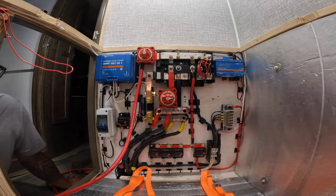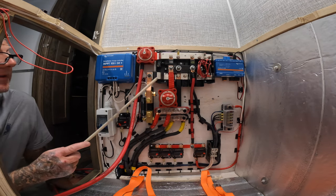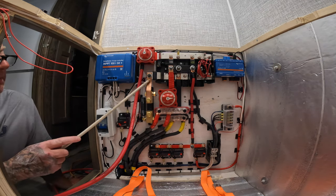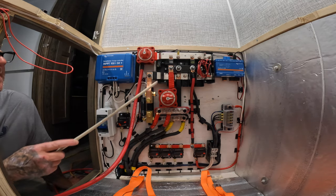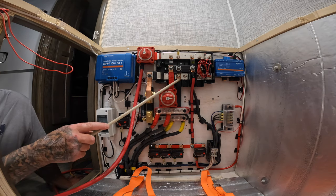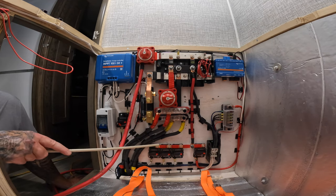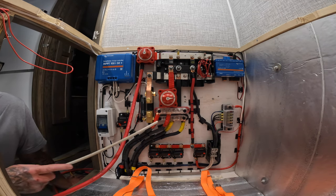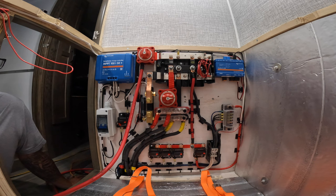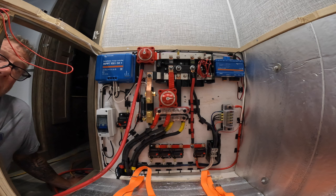Although it looks like a lot of stuff, it's really not that complicated. The only thing I can suggest is keep it very neat — it's a lot easier to troubleshoot later if you have problems. The more times you can get rid of a wire and use a bus, you're far better off. There are buses going to the negative, across to join the breakers, and more. The more you can use a bus over a crimp, it's far superior. So that's about it for in here — I'm going to go put the batteries in and show you when it's totally done.